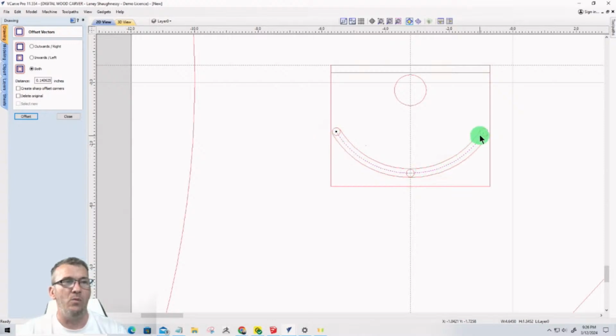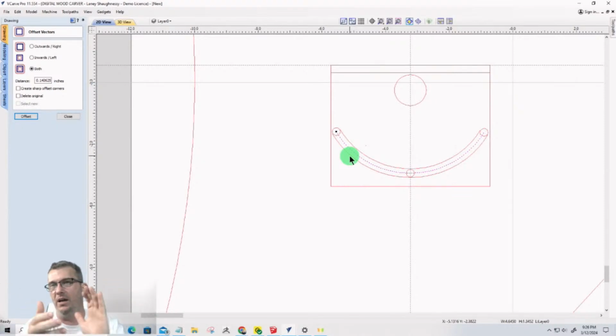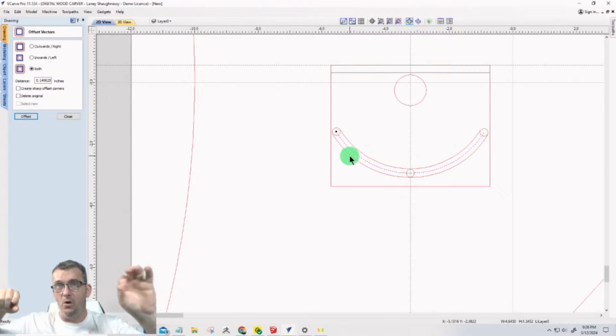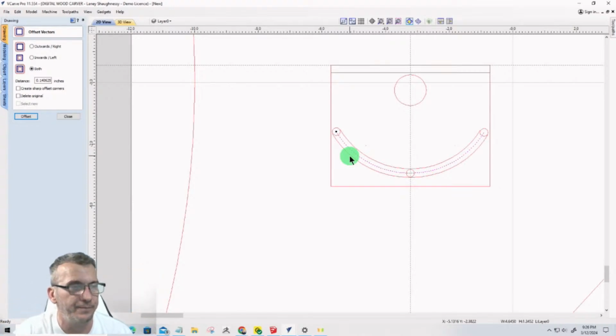I want the freedom of this range. If I want a little bit of a tilt, a lot of a tilt, whatever, I can tilt it to whatever I want, and all I'm doing is tightening one knob with a washer against the bracket. But yes, you can do 15, 22, 30, whatever. You can create your degree of holes and then just pivot to that hole, tighten your knob, and put your bolt in. Absolutely.